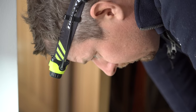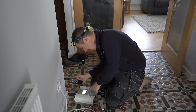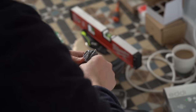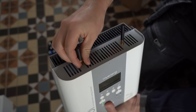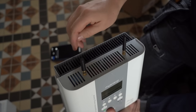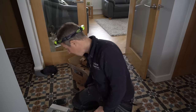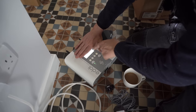We try connecting via WPS — pressing the WPS button to pair — but after two attempts it's not working. Then I realise the antennas aren't screwed on. Once I attach the antennas, it works like a charm. Top tip: make sure you put the antennas on before attempting Wi-Fi connectivity — it makes a big difference. We're now connected to the Wi-Fi network, confirmed on screen.